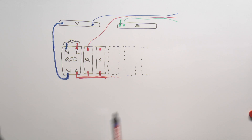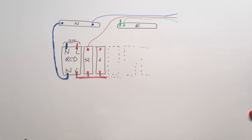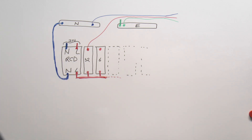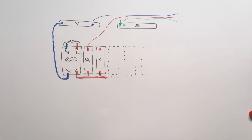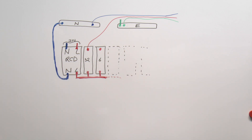In this configuration, if one or more of those wires were accidentally shorted together, nothing is actually going to happen — the circuit breaker is in the off position so no power flows, and none of the other circuits are powered either, so there's no current flowing anywhere in the installation. Nothing will happen regardless of what you do with the ends of those wires. However, if you've only turned off one of the circuit breakers, there are going to be all kinds of other circuits and equipment attached to the rest of the system.